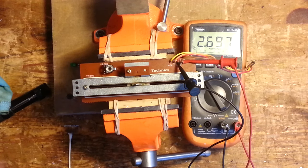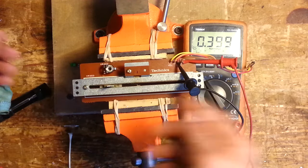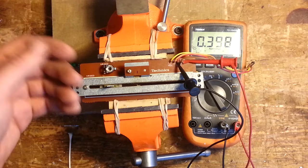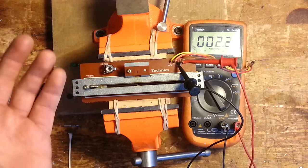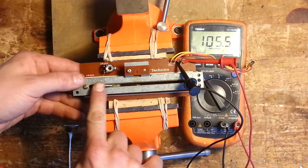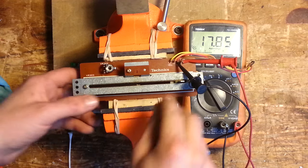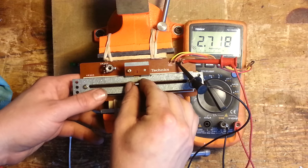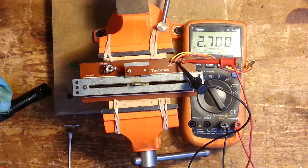That's the calibration part. Now if we want to check that it's working — when we go down to the low position, this would be increasing the speed of the table. By increasing the speed you're lowering the resistance that's back-feeding the drive section of the table, so when you get all the way to the lowest point it should be about three ohms. This one's reading about one and a half — there's a little bit of variance based on tolerances. Then if you go to the upper range it's about 17,000 ohms. Going back to center — look at that, 2.7 right on the money. This fader is 100% ready to go; it's in really good shape and now it doesn't have the center click.